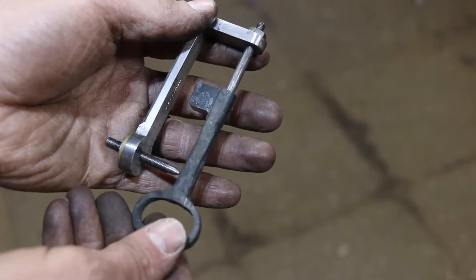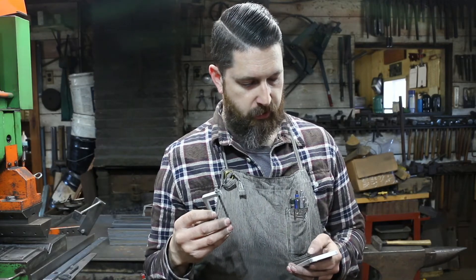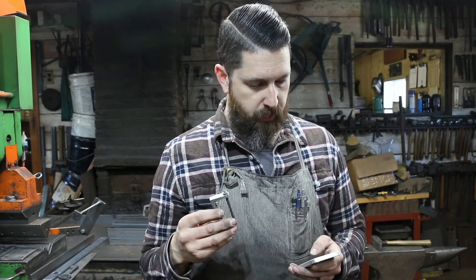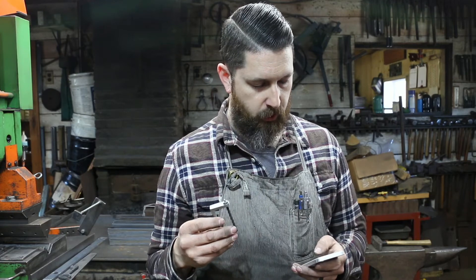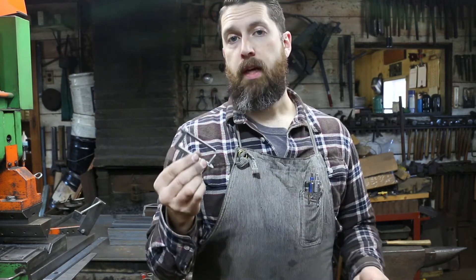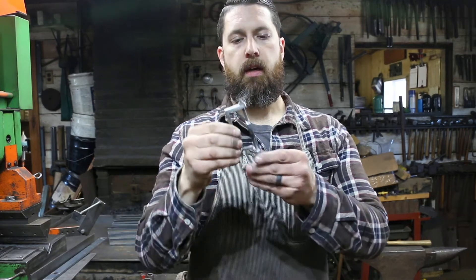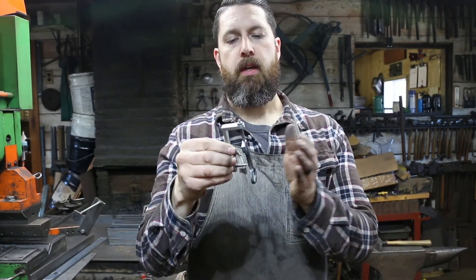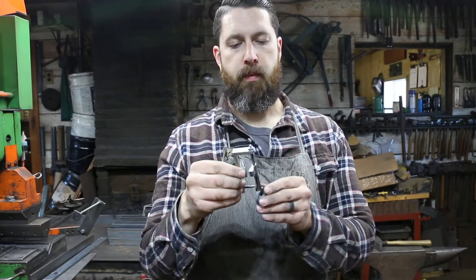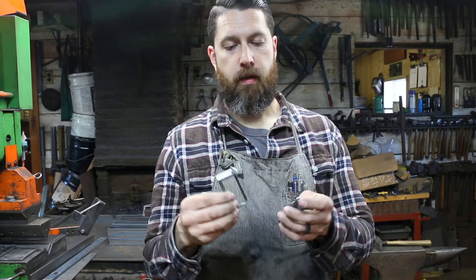The thickness of the key at this point is therefore precisely what is between the pin and the tip. By rotating the stem and making it go up and down, we see if the thickness is the same everywhere. Where the stem cannot pass without pushing back the point, the thickness is greater, and smaller where it touches less. So what this tool does is measure the wall thickness of a hollow stem key and allows you to gauge if it's even, so when you're filing you can even it up and get that hollow bore centered on the stem as best as you can.